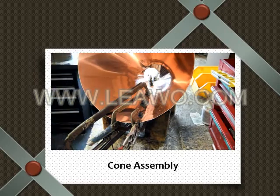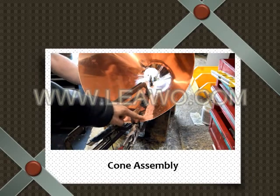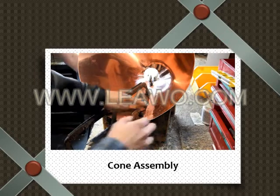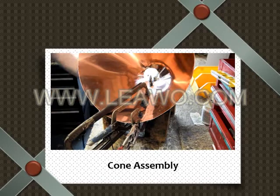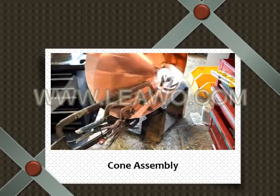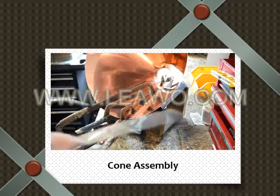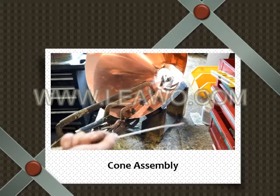Now, Bobby, when you're soldering it, I want you to go nice and slow. You start off with the heat here. You get this hot. You continue to move the flame up. And you start applying the solder behind it because the copper's already hot. You don't have to go too hot either. Yep, that's a good angle. Try to go like this as much as you can. A long strip. That way your arm's not in there.